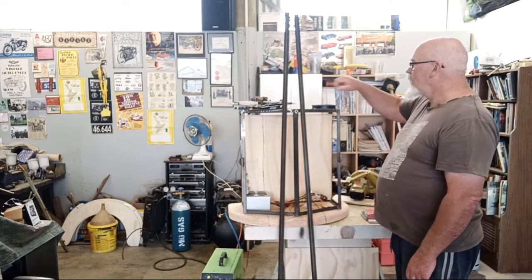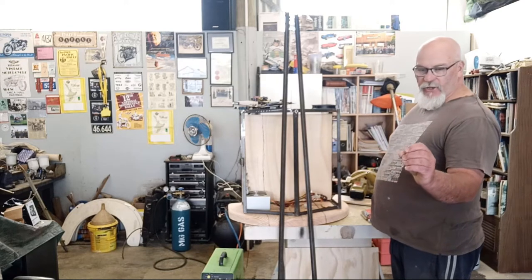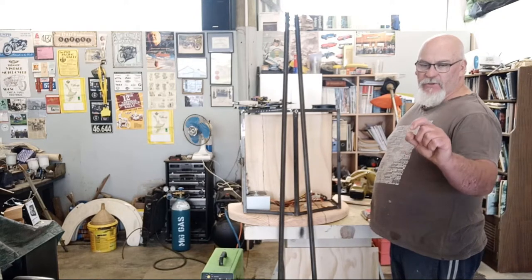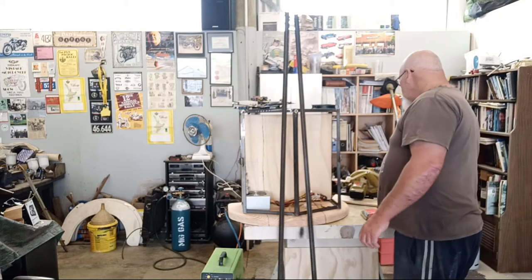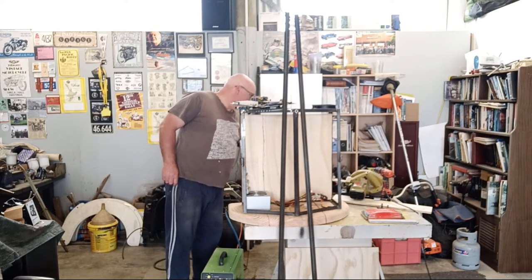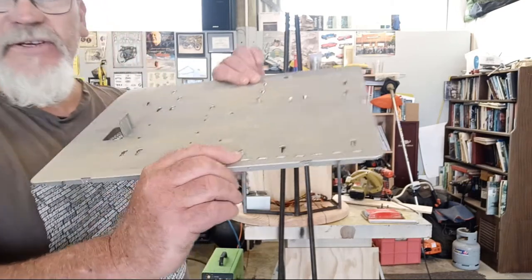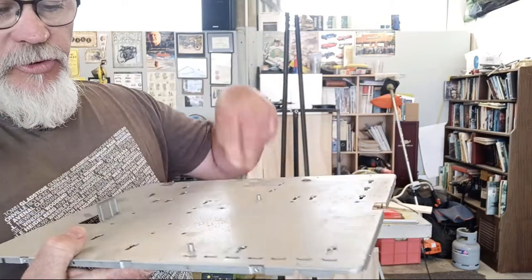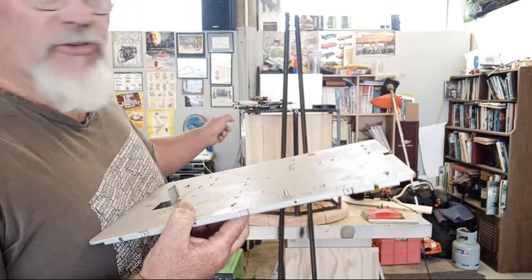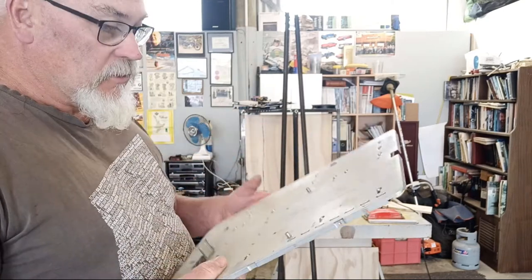And I also need to work out how I'm going to attach these to there. You would normally use what they call a standoff. It looks like a little nut that's got a bolt on the end of it. They're not very long, they just stand up a little bit. I did show you one other time. I did have one here, but I wouldn't have a clue where it's gone. But I can show you on here what it's like, that little thing there. They screw into the board, so I need to find out how I'm going to screw them into that. They would screw into that, but they wouldn't hold very long, because they would eventually rip out of the ply if you're removing the case around a bit.